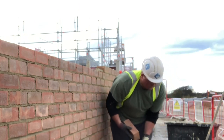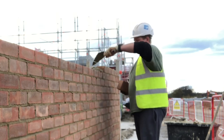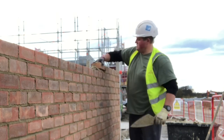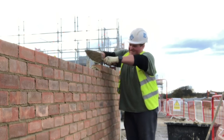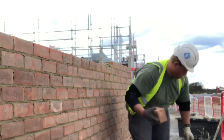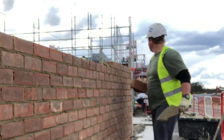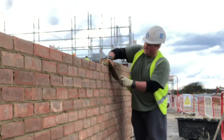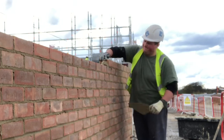On the fourth stack, take the brick clamp off, flip three bricks the opposite way on to give the stack some stability. Then six, six, six straight away, and try to get the stacks as close to chest height as you can, depending on whether the ground is stable or not. If the stack's looking a little bit wobbly, take a few off. And then stack your mortar boards, ideally on some mortar board stands.